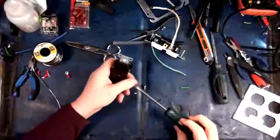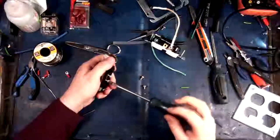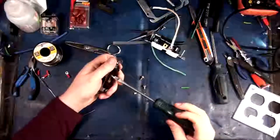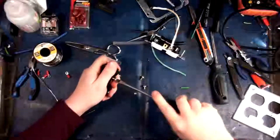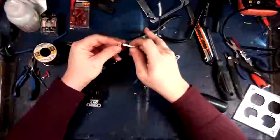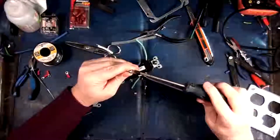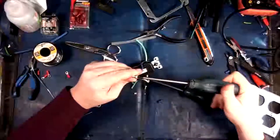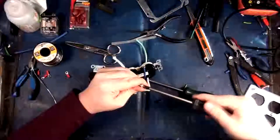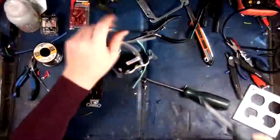And by the way, these are commercial grade receptacles. Yeah, we'll be going hard on them, so I want to make sure that they'll hold up. There we go. Oh yeah, so now we can take this guy here. I'm going to daisy chain them like you normally would. Each one gets its own terminal, just makes things a little bit easier, especially when you're using spade connectors. I may have to put the file over that because it doesn't look like it's going to be a happy one.